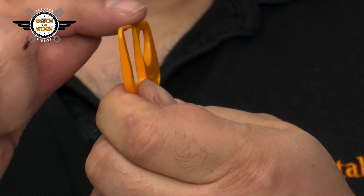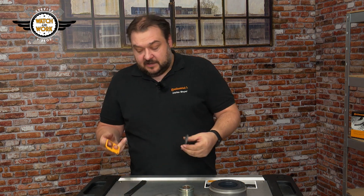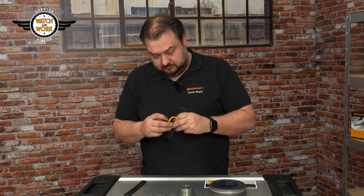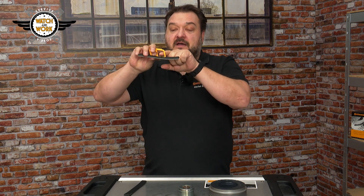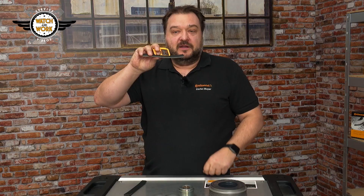This check can also be carried out with the belt still fitted. Here we have exactly the same wedge shape, but in a lengthwise format. This allows you to insert the tester into a tension belt and then check whether its plastic edge is noticeable. In other words, you just have to check whether you can feel the plastic or not when using the tester on a fitted belt.